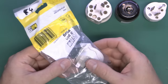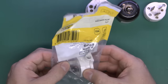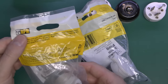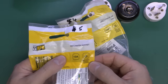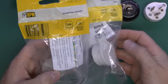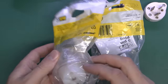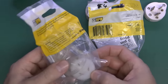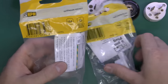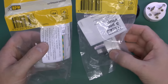Now here we've got some rather more up-to-date items. This is the plug — notice it's got sleeved pins for the line and neutral, though again the earth is unsleeved. And the corresponding socket here is a fairly up-to-date newer item. Notice it says approved to Australian standards — of course it's the same design as used in Australia, so presumably they make the same packaging for both. That's your plug which fits onto the cord, and this is your inline item for the end of an extension cord. So you've got your plug there and then your lead comes out of the back. Rated 10 amps, 240 volts — not too dissimilar from the UK style but reasonably similar.